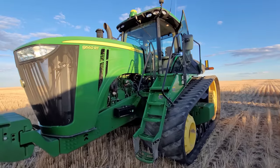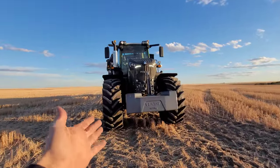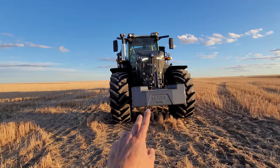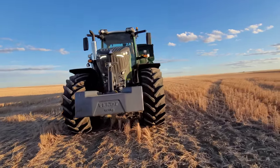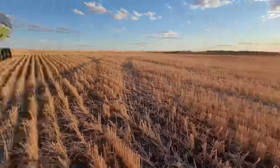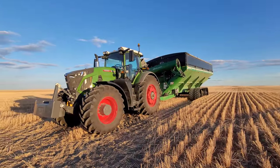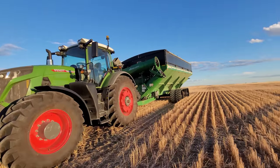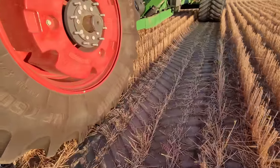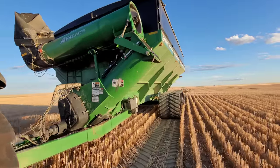But to be honest, we don't grain cart fast. The top speed you'll ever see any of our carts going — and they better not be going over 12 or 14 miles an hour, drivers — that's top speed. Because we don't want to abuse the cart and we don't want to abuse the tractor. I like to pull them, I like to work them, but I do not abuse them. So let's shut this thing off. Also, I should note that this thing is all-wheel drive all the time — there's no switch for four-wheel drive, unlike the 930 or the previous gen. So this is a 2000 bushel cart. Got to let a little air out of these tires — get a little squat on that because there's already some grain in there.